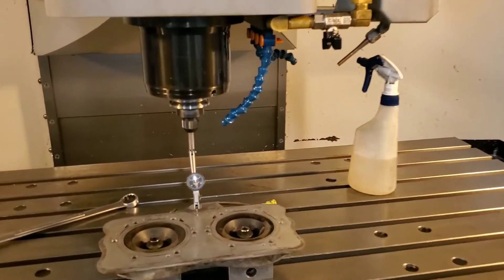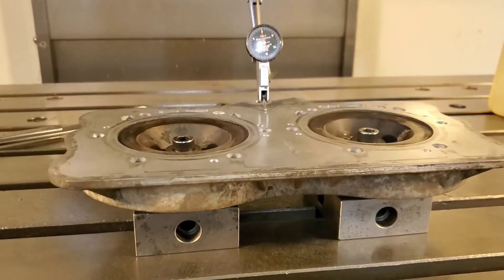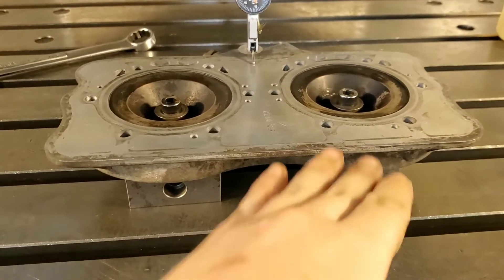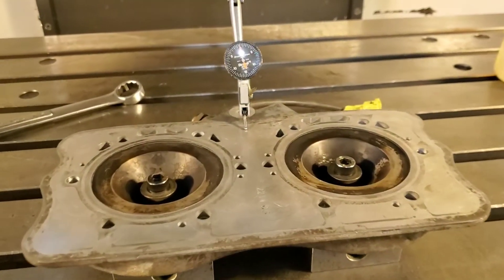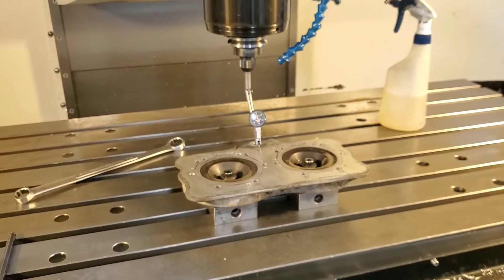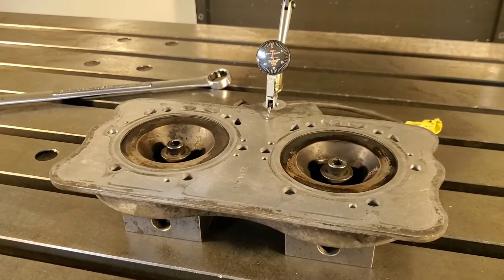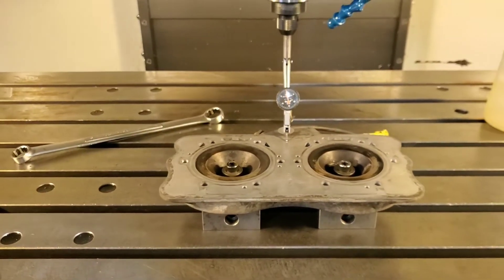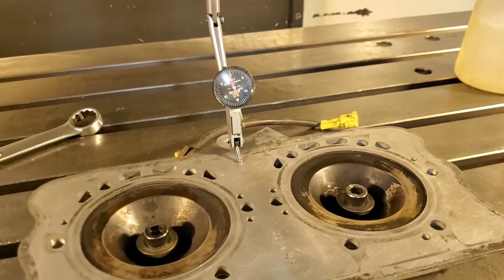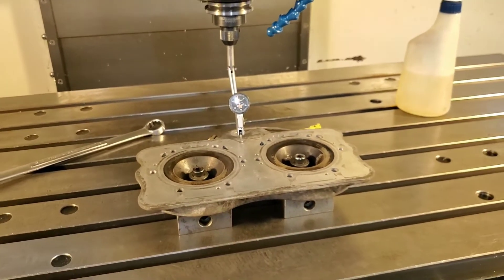I have gone ahead and set up this head on these precision blocks, and the head is now flat to the surface that was machined flat — as flat as this head can be. In this type of situation I don't have specialized fixturing for heads, so you have to get creative with holding it, but I have used this method before and I am certain it is going to yield good results. I have now set up the indicator inside the machine, which will basically tell us the same thing as I got at the granite table, but this is the best method in this scenario because this is the way it's going to get machined.